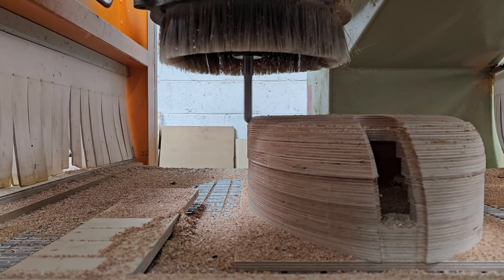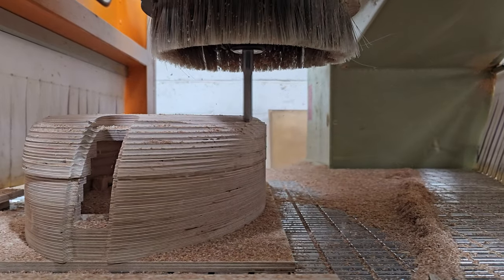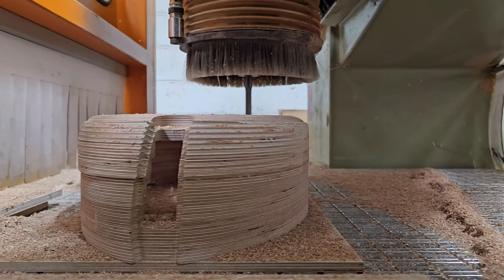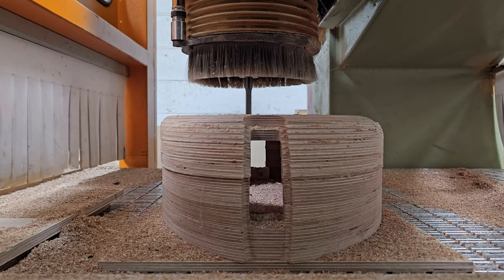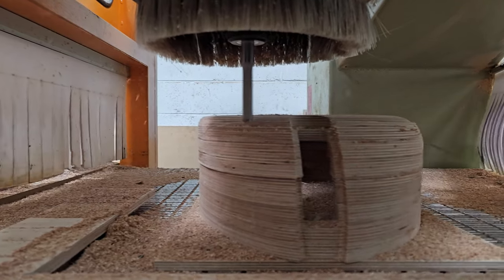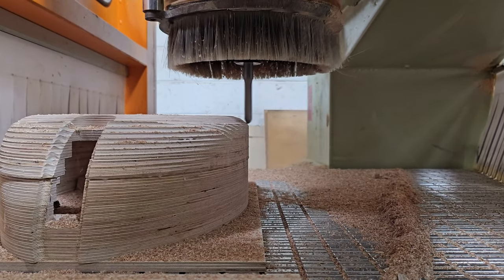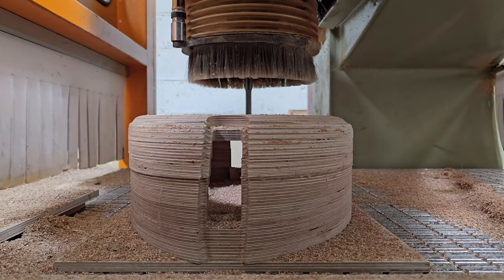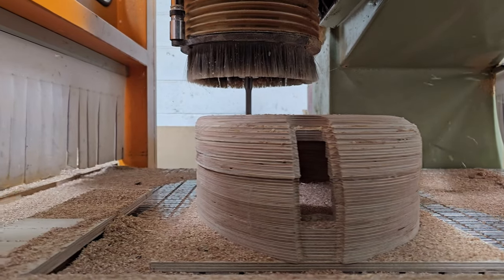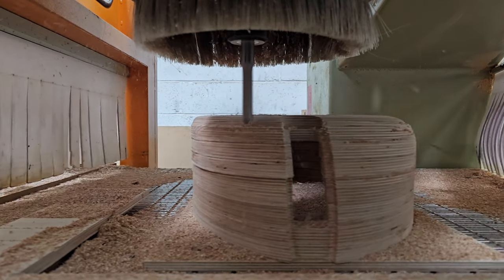But while it's doing the cutting on the other side of the machine, you clear all the parts off the first side, you clean the bed down, you put a new sheet of material on, and then when it's ready, you just press the vacuum on button and the start button, and it moves over to the other side and moves back to side one and starts doing that. And then you start unloading the parts from the other side, and you kind of have this, it's pendulum. You just move backwards and forwards. And what it means is you've not got downtime where the machine is idle when you're unloading parts.